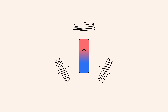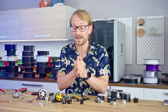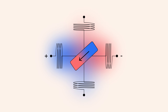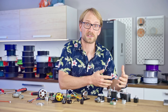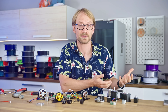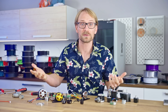For example, if the motor is already where we want it to be, we can just stop sending current to it entirely. Not so with stepper motors — we constantly energize them because we don't know how much torque we need at any time. That ends up being too much when the motor isn't being taxed much, and might be too little in rapid accelerations or when the print is curling up and starts interfering with the nozzle. It's like you're always pegging the throttle in your car because you don't know if you're going up a hill right now.